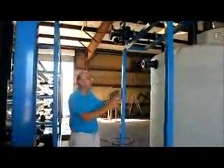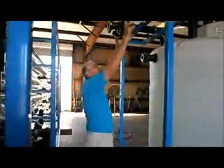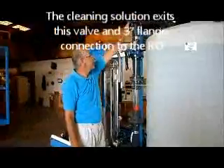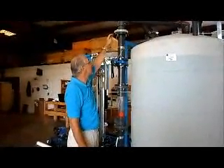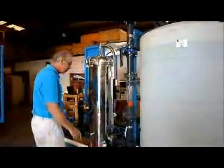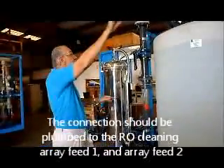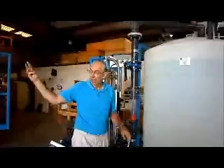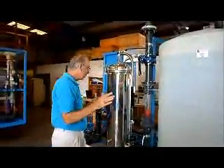The way the cleaning station works: the solution is pumped out to the RO skid or off to the EDI skid, goes through the EDI or RO skid, and then comes back to these two return pipes. Now on this side you'll see the outlet. This is where the cleaning solution exits the system — through this valve and out through this flange. The actual installation connection should be made with this three-inch flange right here. When the cleaning system is running, the cleaning solution comes through the cartridge filter, through this flow meter, through this valve, and out the top. During installation, make a pipe from here to the cleaning solution inlet of array one, array two, and the B inlet to the EDI — three connections, T'd back to this pipe. That's all your piping connections on the skid: five connections.